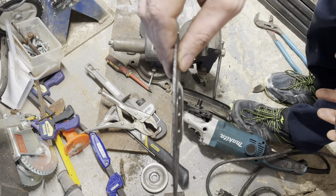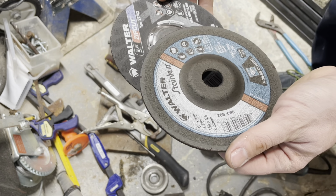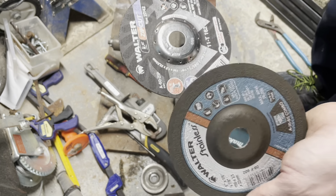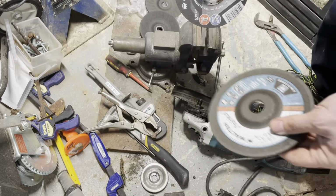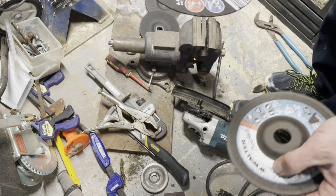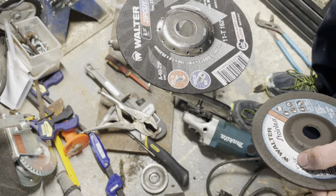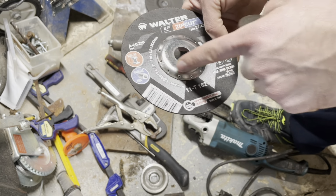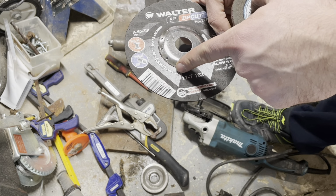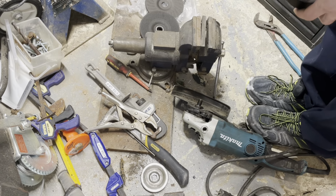And this is your straight cut blade. So this is both for stainless and then mild steel, and this just says stainless on it, but obviously you can use it on mild steel too. I would believe this to be a bit more expensive. Now, this is a 6-inch blade. Yep, says right there. Says the size, 1/8. I'm just trying to see what the size on this one is. There it is, 3/64 times 6-inch. What do you call it?